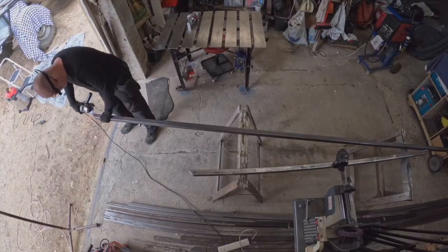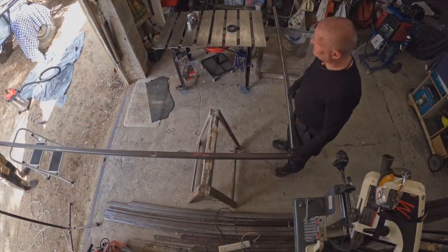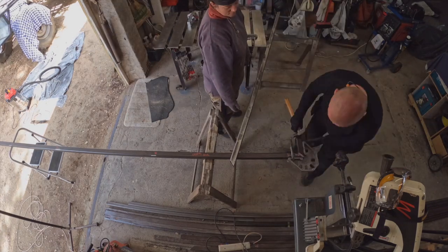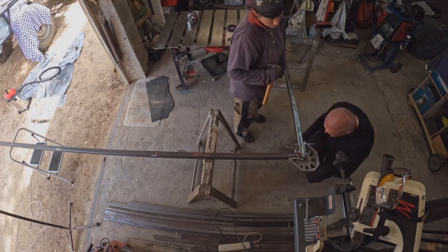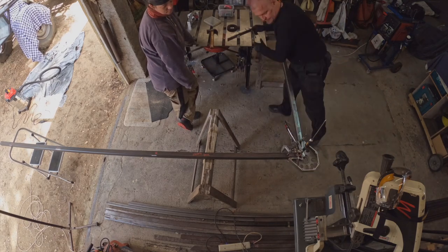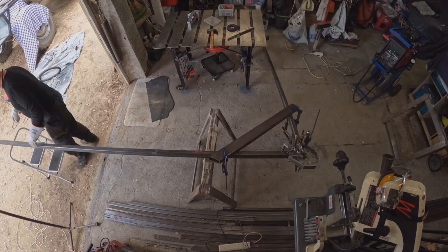Like I said, first we need to chamfer the top and bottom of each end. Once that's done, we'll do the 3 points as a plane thingy. Thanks to the Fireball Tools Mega Square, it's quite easy to clamp the L piece together. As long as it's clamped well and the bar can rotate to align itself, then we should be tickety-boo. An extra thick piece of metal will assist in the parallelness. Then it's just tack welding. Oh, did I say just?